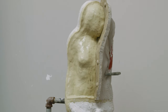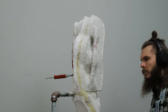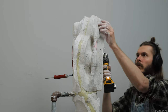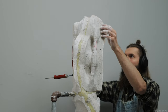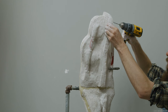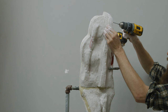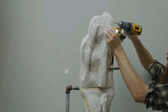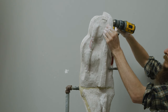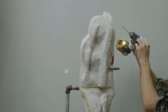Since the next piece is just the same as the process we just observed and did, I decided to skip it and move on to the next piece. The next step is drilling holes that we will use to bolt the two model mold pieces into one model mold half. During casting, these will be bolted together and function as one model mold half. And during demolding, they will be unbolted from each other, letting us demold our piece much more easily. The silicone, of course, is flexible and so it can flex around some of these undercuts, but the model mold needs two pieces unbolted from each other to get around them.